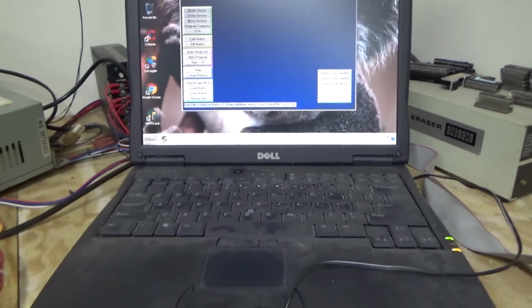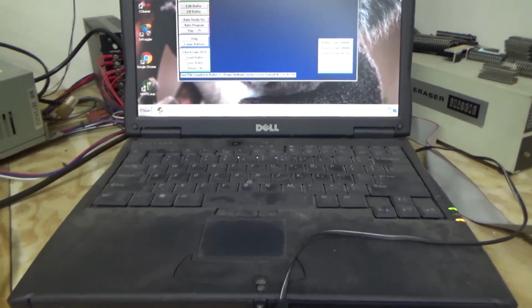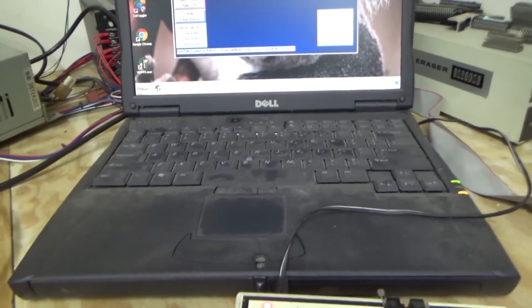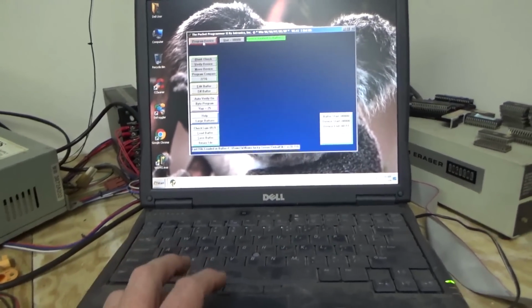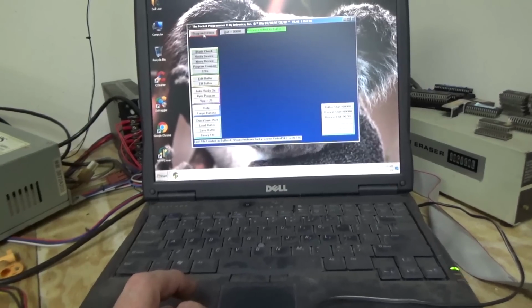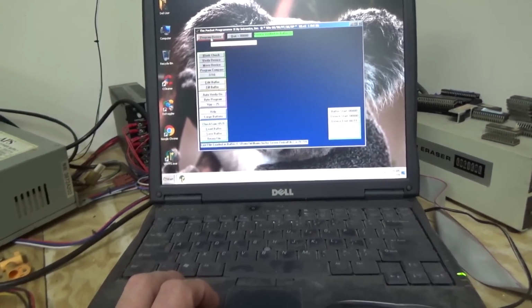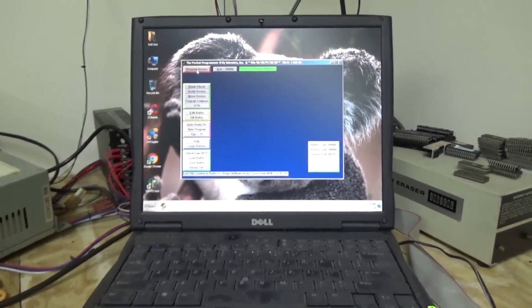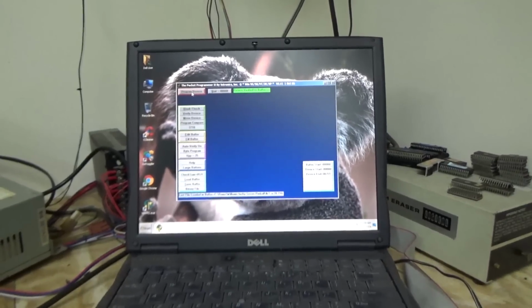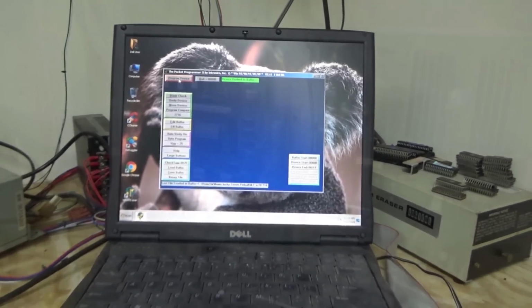You know, in modern electronics, you can't get your hands on any way to repair anything old. But Williams Pinball actually lets you have their old software. So I am programming the 3 little chips we need as we speak, that we can pop in the original MPU from 1978. And we'll see if the thing will decide to boot for us.